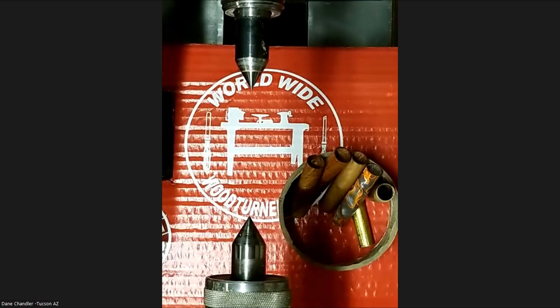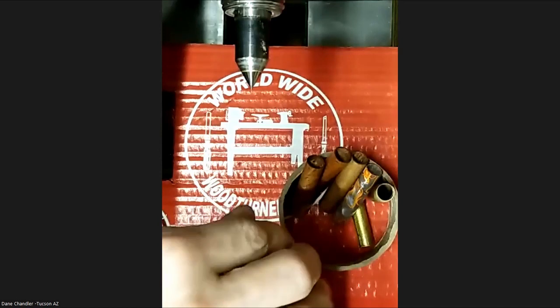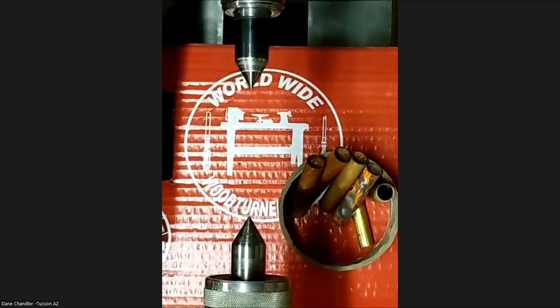On a friction drive like that, Dane, you get a lot more tool control, because if you plunge hard at it, you're going to stop that timber. It's not going to turn. And as soon as it starts spinning, you're going to have to tighten your tailstock up, and what will end up happening is you'll split the timber, depending on what you're turning. So by putting it on a friction drive like that, there's a lot more skill involved in turning it. Right. You'll get a lot more tool control from it.